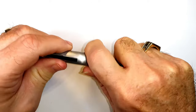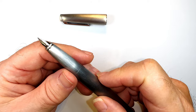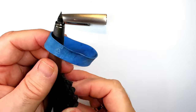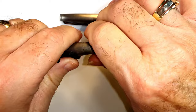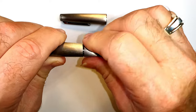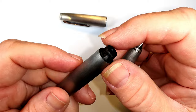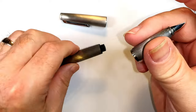Let's first take the cap off. The first time you try to unscrew this section, you kind of need to give it a little bit more pressure because there's some kind of adhesive on the inside of this section. So I put my gripper on it — my elastic band — and I gave it a good turn. Now it comes off a lot easier, of course. And when you unscrew the section, it has a bit of a grating feel to it. There, the section comes off. And these threads were covered with some kind of a granular adhesive. I used a soft brush, like a toothbrush, to get that residue off of there and cleaned it out.